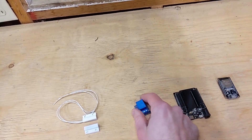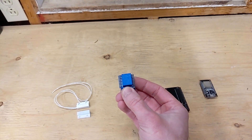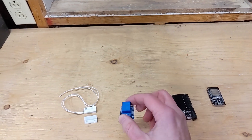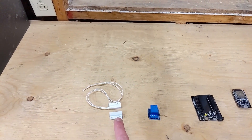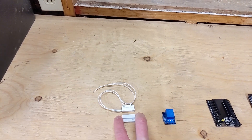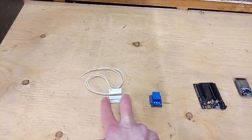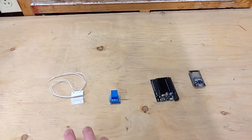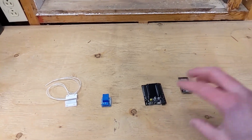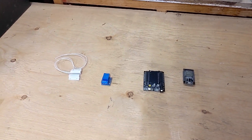The next thing you need is a basic relay. This connects to the ESP32 and completes the circuit to send the signal to your garage door opener — just under $2. The last component is a sensor: one part goes on the garage door, the other on the wood frame beside it. When the door moves away, we know it's open; when they come together, we know it's closed. This was all under $10 shipped, including tax, in Canadian dollars — so about $7 USD.